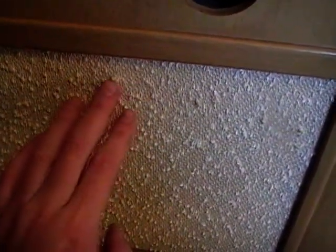This cabinet is made out of what they call blonde Corina wood, also known as Limba, which is a nice light wood that comes from Africa and gives it this really nice 50s blonde finish look. The speaker cloth was pretty well stained with a stain from the grill behind here — it's in a 60s-style V shape — but I used some stain remover and then some bleach and I think this came out really well.